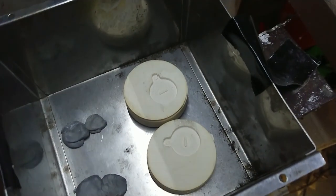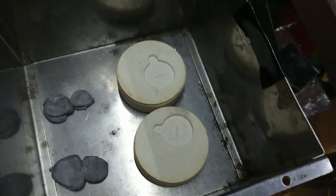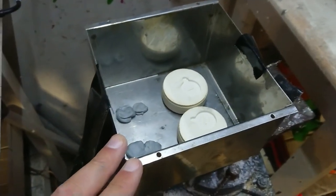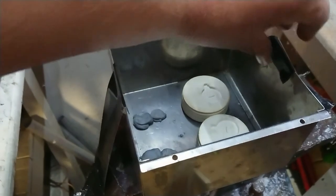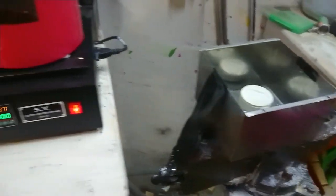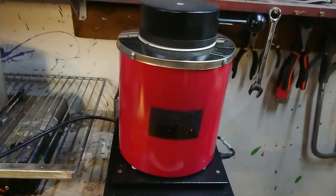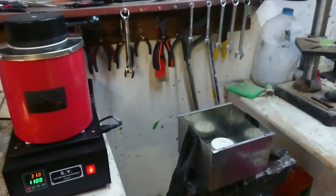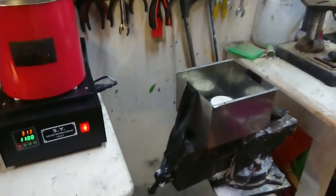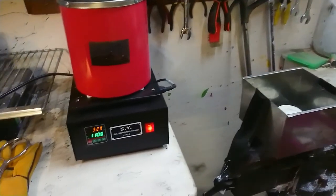Our molds have been in the gas oven at about 200 degrees C for about an hour and they're quite dry, though I'm not sure if they're dry enough. I've got them in a little stainless box so any overflow won't land on the ground. I've got the barriers set up and this taped down to the vice as a precautionary measure. We have our original bit of brass in the furnace plus a whole bunch more 38 Special shells. The fan is running and I've also got another camera person this time. We've got decent multi-purpose tongs and we'll be pouring some brass when we're up to temperature.